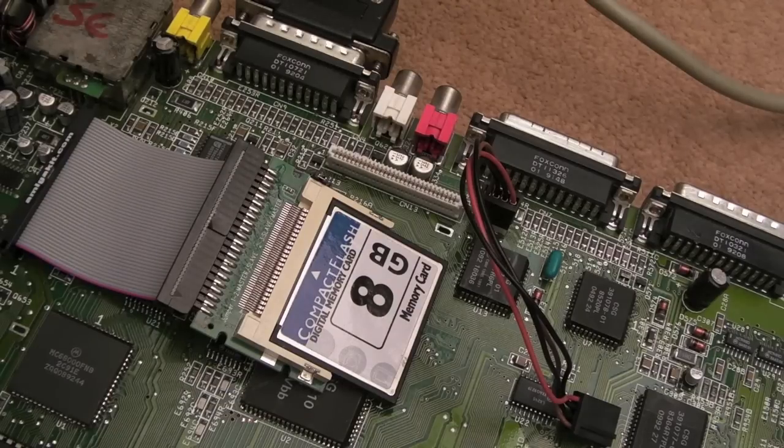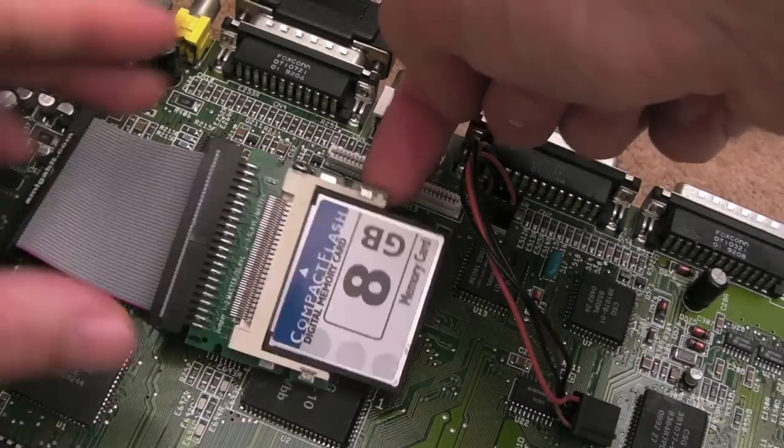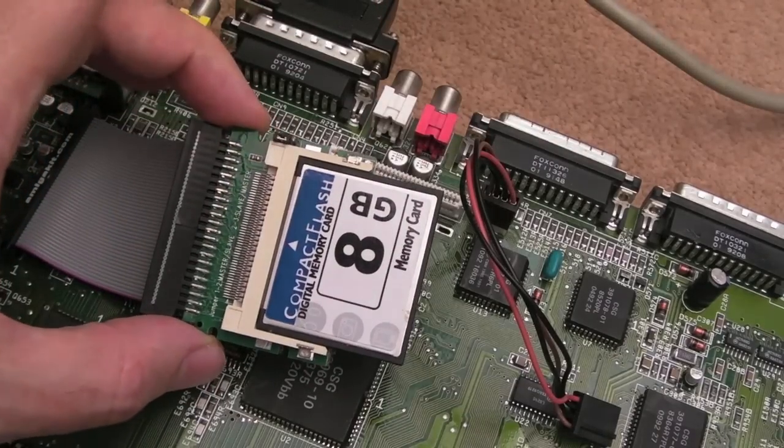See, I don't think the ROM's the issue, but I've just connected up IDE on a hunch that maybe the buffering for the IDE is the problem. I'm getting the red screen an awful lot now I've got the IDE connected, so I'm thinking that's what it is, actually. It's almost repeatable now. You can switch it off and on, you get a red screen, then you don't, then you do. And if you watch the LED here, see how that time, we've got nothing.